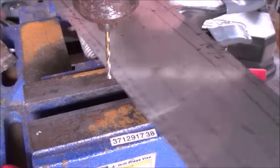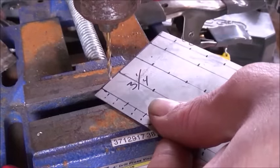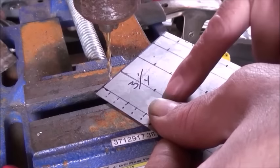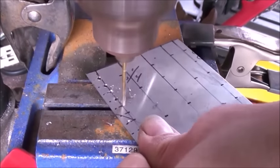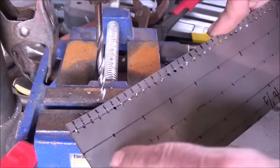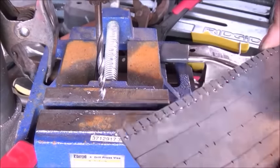I just got done shearing out the outer wall of the burn chamber. Now I'm going to take a 3/32nd drill bit and do our first set of holes — the quarter inch spaced holes towards the compressor side of the burn chamber. Now we're done with the top set of holes. We're going to drill our second set using a 3/16th inch drill bit spaced one inch apart.